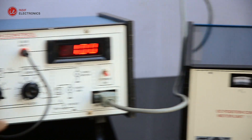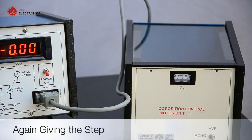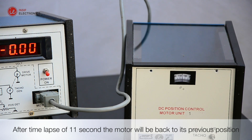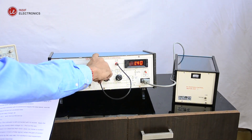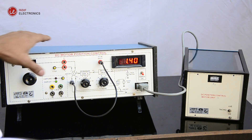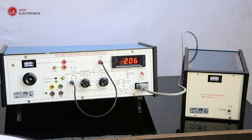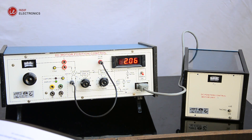After a time lapse of 11 seconds, the motor will return to its previous position. Connect the voltmeter with the VO socket and reapply the step signal. Note the new reading of VO as VO1 at steady state. Calculate the step change as V1 equals VR plus VS, and find out the steady state error ESS equals V1 minus VO1.